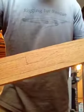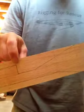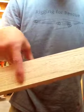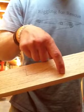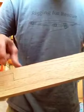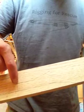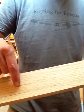What I've done here for this section, and you can experiment with that, is where the sight window from the arrow shelf through the sight window goes back up through the fade, I did this side of the bow the same as I did the other side. So I've measured 4.5 inches out, 2-inch fade out to full thickness of the board. On this side, I did a measurement to the half width of the bow, so it's 3/4 of an inch to center.